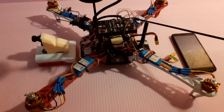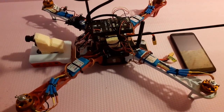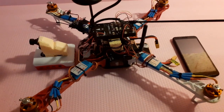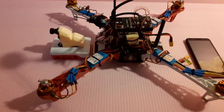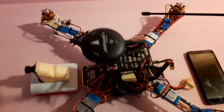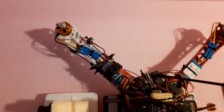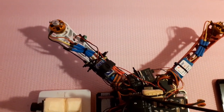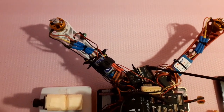These little blue things here — they plug into this power board under here, and that's plugged into the Pixhawk flight controller. Here's a GPS sensor for the flight controller. Over the back here you've got the radio receiver for the radio control, which is plugged into the flight controller via its S-Bus interface.